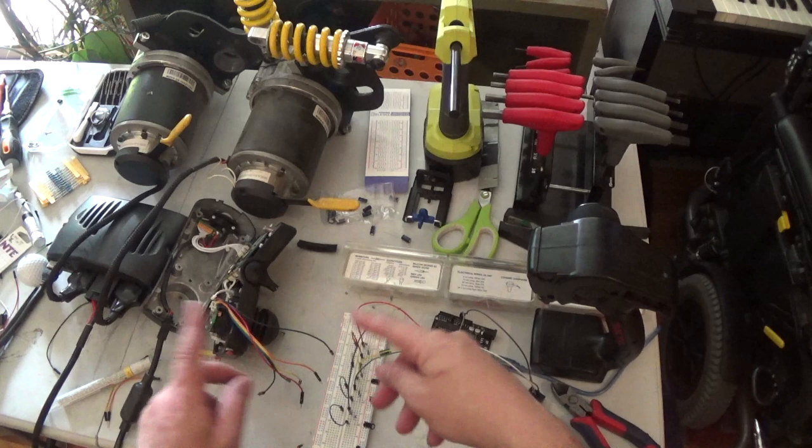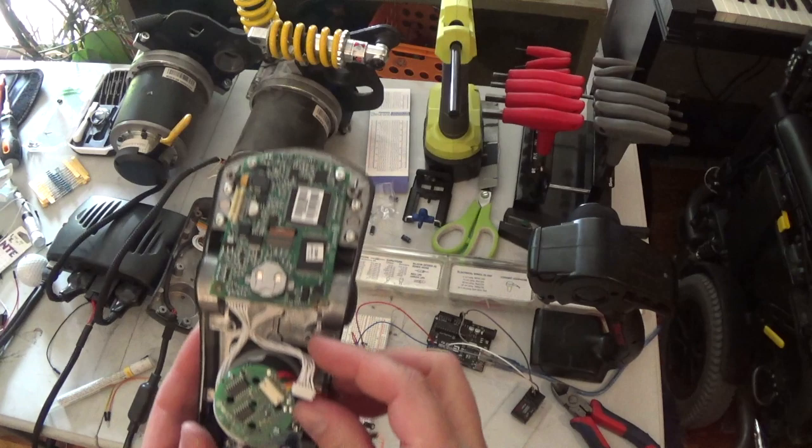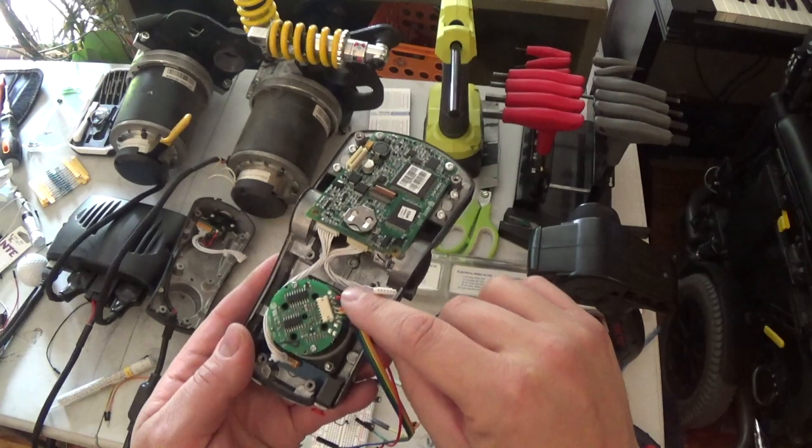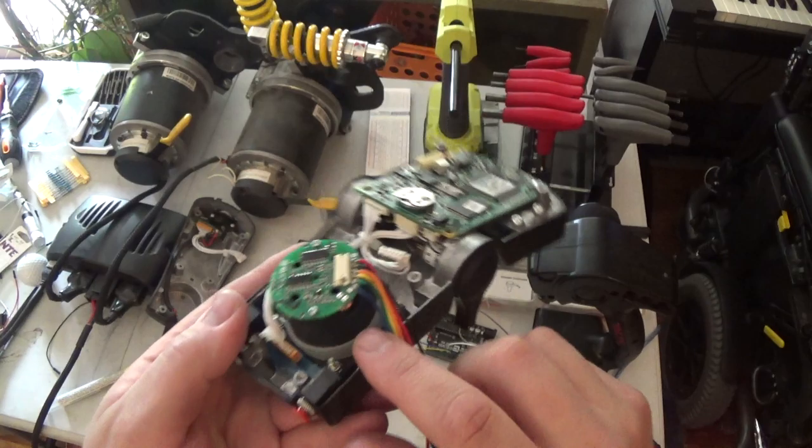So what I'm going to do, I'm going to take this joystick and actually take this harness apart. And we're going to solder all these wires that are color-coded onto here. I thought originally that I could just use these probe points and solder everything on there, but then I realized this has to be connected. And when all this is connected, we're trying to power up these little coils in here, so that's going to throw our voltage off and make it all screwy.